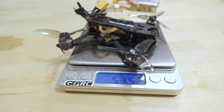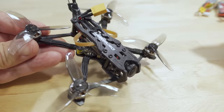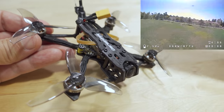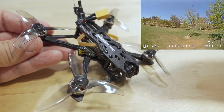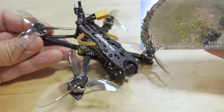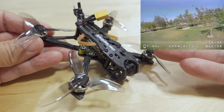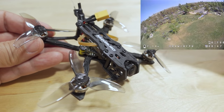The quad weighs 53.5 grams, and with the 2S 450 battery it comes in at about 81.3 grams. In terms of how it flies, the PID tune isn't great — you'll see that in the narrated flight. Betaflight 4.3 still has a lot of tuning options that many people, including myself, don't fully know how to use properly. The flight footage shows a lot of wobbles and it just doesn't fly that correctly. Unfortunately, since this runs ExpressLRS built-in via SPI, you're stuck with Betaflight 4.3 — there's no way to go back.